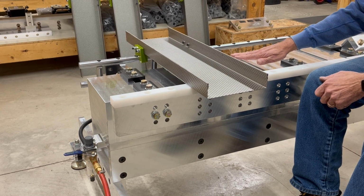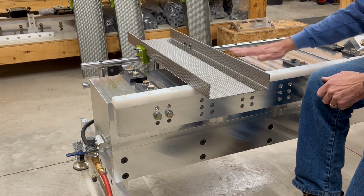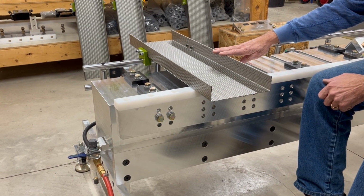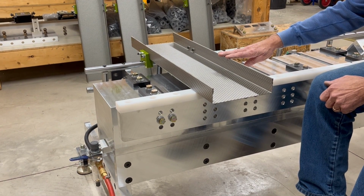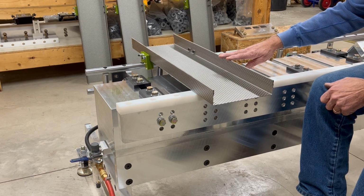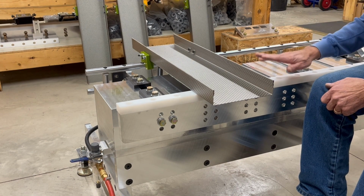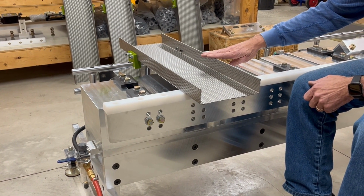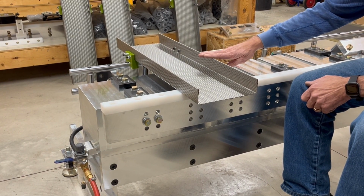For instance, maybe the top of the bolster plate or a sub plate, to get that tray suspended above the obstructions so that the bottom of the tray is not rubbing metal to metal on the obstruction. And then the last benefit, which is the most important, is that these platforms will promote tray life. So they'll really increase the life of your conveyor trays.